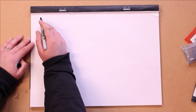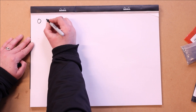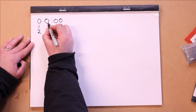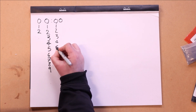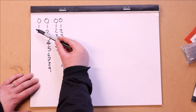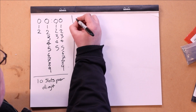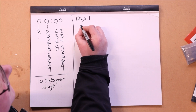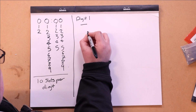For my clock idea I have a few options. I could do each acrylic sheet as one of the digits — for the hours first digit I'd just need a zero, one, and two, then the second digit, and so on for minutes. But that feels a bit messy with unequal numbers of slots. I could make 10 slots per digit for more flexibility, but my other idea is to make an edge-lit seven-segment display where each segment is one piece of acrylic.